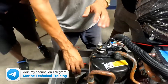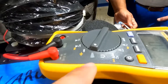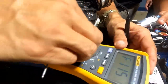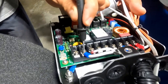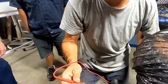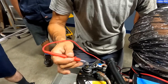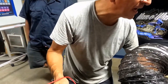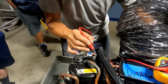If the unit never starts, here is how to diagnose it step by step. Number one: go to the neutral bus bar, put voltage here on AC. Go to the neutral — the white one, the neutral coming from the shore power. Check the hot line coming in — I have power here: 120V. But I don't have power here. That means a bad thermal switch. I replace the thermal switch and now I have power here.